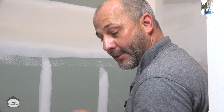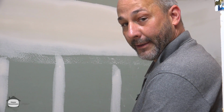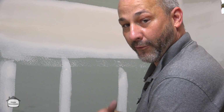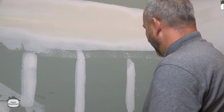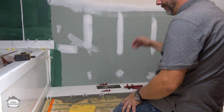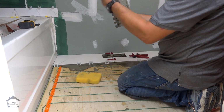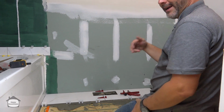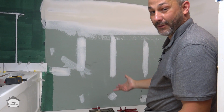That one had large and small and little mosaic pieces to install. So by using the floor leveler, it allowed me to go with a much thinner amount of cement and have a lot more control over my tile installation, so I didn't have cement oozing everywhere. In this situation, because it's such a large format tile, I can install the heating cable and the tile at the same time using this 1/2 inch thick trowel line. That way, I can save time and money and have this all done in one step in a few hours instead of taking 2 days.